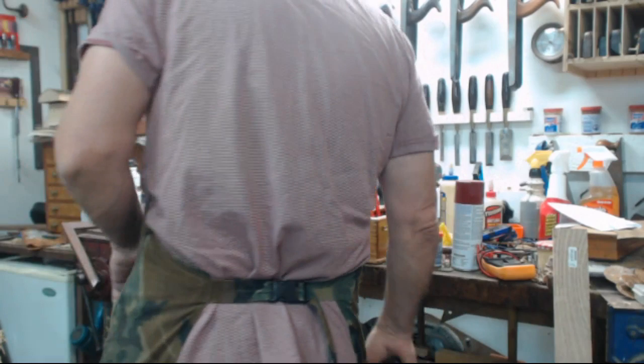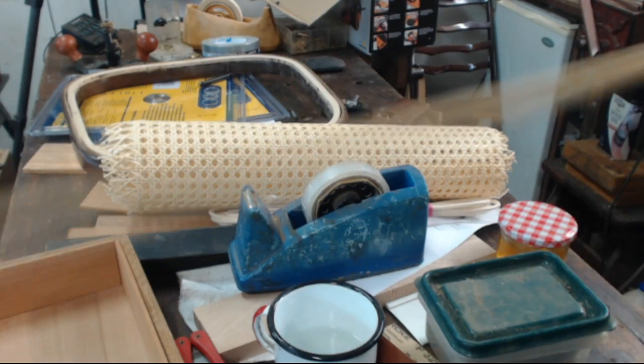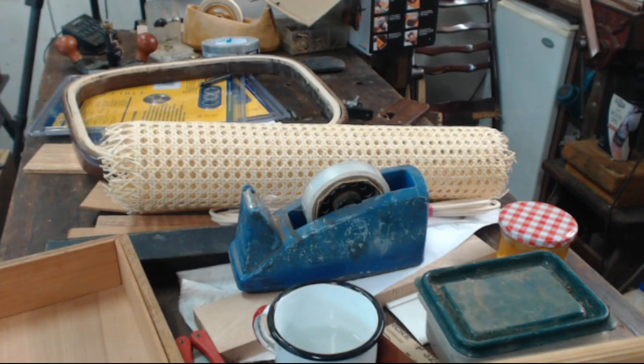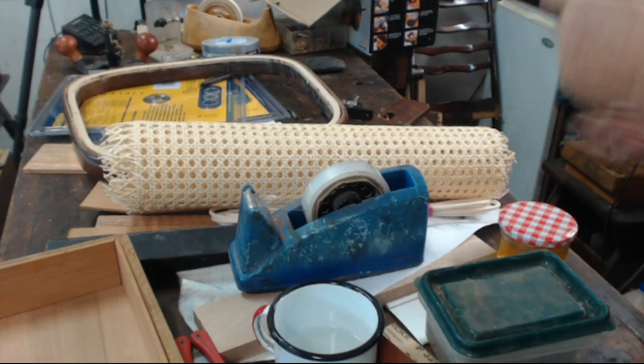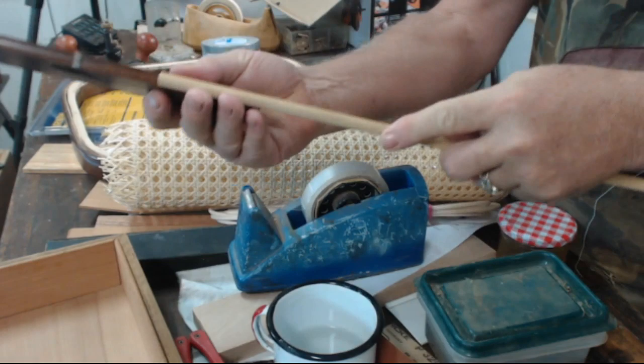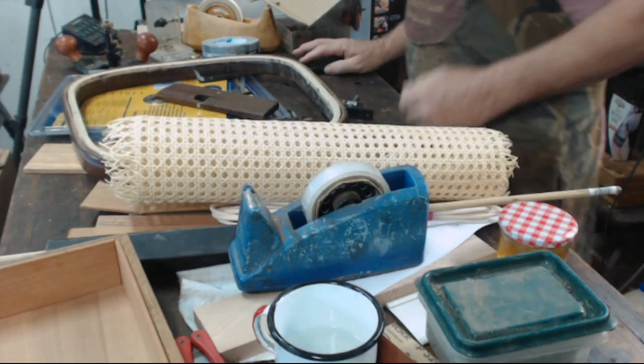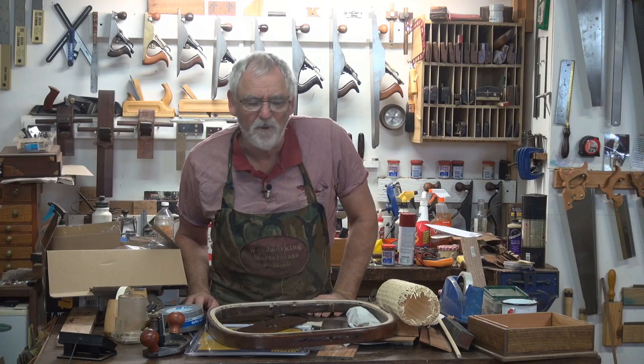I think actually this dowel I bought from Masters when they were going. Let me just organise this. I think it might even be written on there, 9.5. What have we got here? Oh, 3/8, there you go. Get in focus. 3/8 dowel. So that's what I used, and that fits nicely into the sole of the plane. So that's all you need. 9.5 mil.